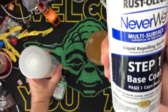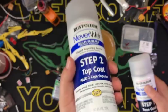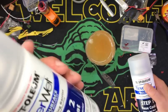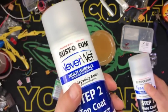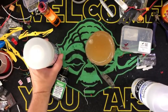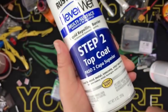When you're done with that, go buy this — I got it off Amazon for about 8 to 10 bucks. This is NeverWet by Rust-Oleum, and this stuff is amazing. It's a hydro displacement spray. You can literally take a piece of toilet paper, spray it with this stuff, dip it in water, and it'll come out perfectly dry. I'll put a link in the description to one of their test sites — go watch a couple videos, it's really cool. After you conformal coat your boards, spray this on kind of like spray paint — not too close, about six inches away, do a couple passes. Let it dry for 45 minutes to an hour. I let it dry in 90-degree sun today for 45 minutes and it was fine. Then do a coat or two of the step two, and you'll get that smoky look to it.